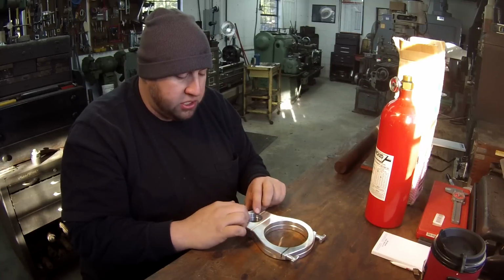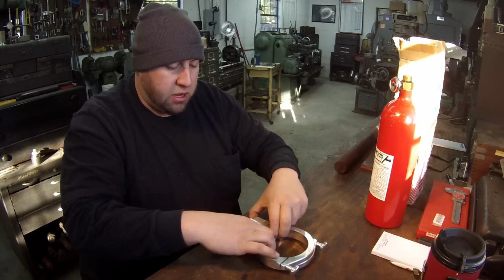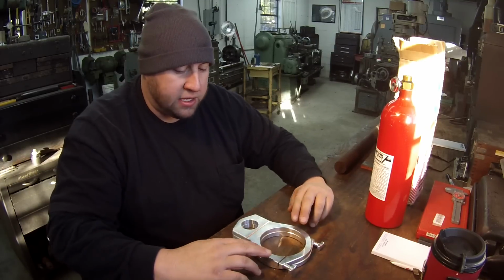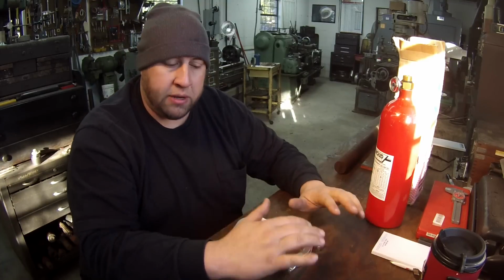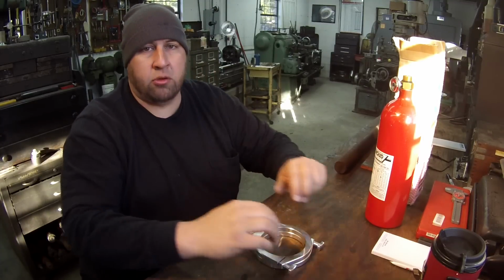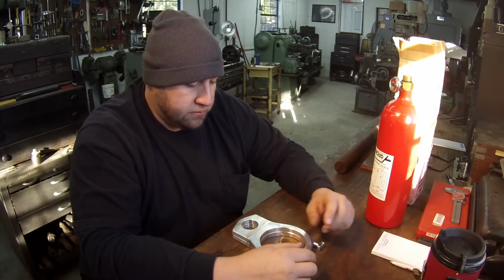So I'll turn me a piece of shafting that both of these will clamp to, and I'll have that mounted in the milling machine, and then I'll probably come in here on the sides and just put me a couple toe clamps here on each side of it to hold them down. I'll put them on some parallels and pull them down, and it'll be clamped on the back there too. Center it up and bore it out.